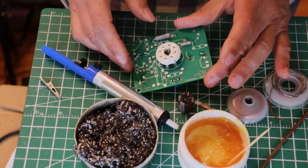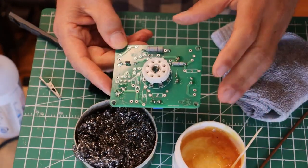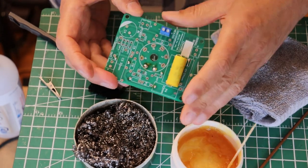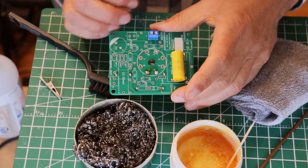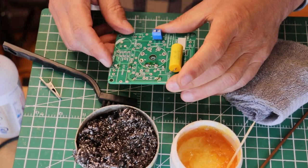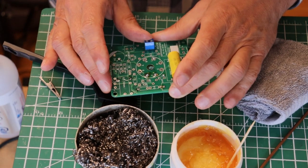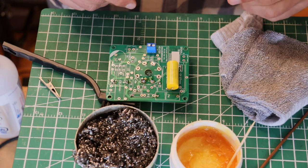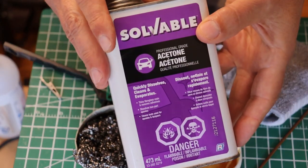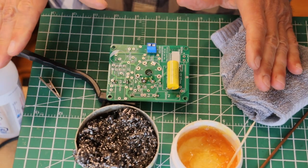That's how to solder and how to desolder. What about when the board is all done - what do we do with the flux? With no-clean flux you can actually leave the board as is; the flux won't conduct electrically and it'll be fairly safe, but it's not the best practice. Removing the flux is a good idea. This should be done outside with full ventilation - set up a little work area outside.